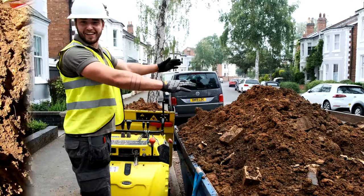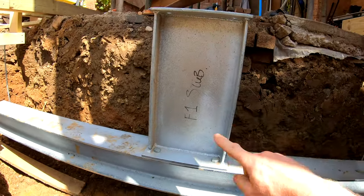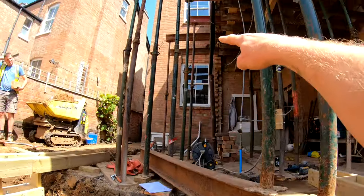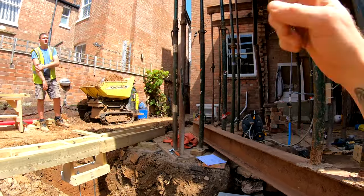We've got a large steel here which we've encased fully in concrete. This stub here will then carry another beam, which will go straight up and carry the cantilever across there. That will square off the building so we can plumb everything through.